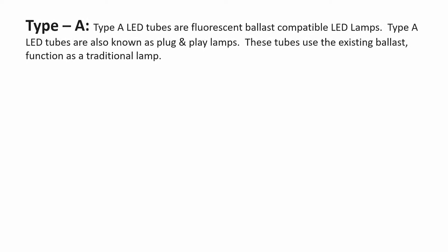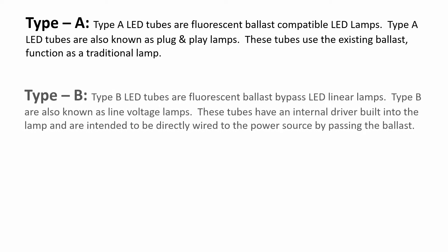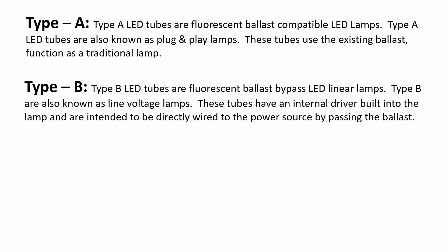There are four different kinds of LED tubes but only two are commonly used. Type A is the common one — these are the ones that you can just trade out right now with a working ballast, and this is what I've been using the last four years when my fluorescent tubes burned out. One thing to take note is that not all Type A bulbs work with all ballasts.